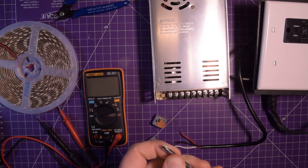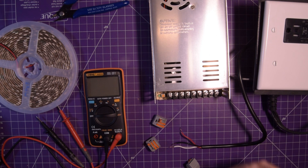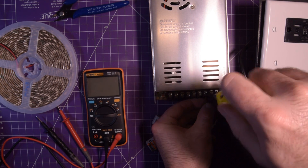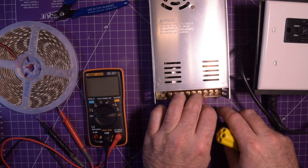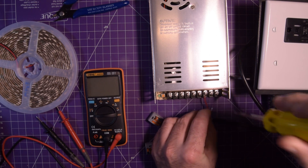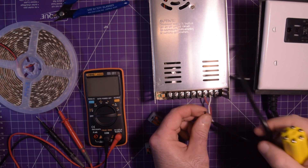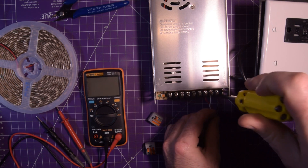I'm perfectly fine when things are unplugged. I'm also perfectly fine when I don't have to touch the device to turn it on or off in case of anything going wrong. That's why I built that little test unit. It's not a fancy commercial unit because I didn't have a hundred dollars US to throw at one, but it does work. I think compared to just shoving wires into an outlet, I have several orders of safety magnitude more than that. And this cable is actually running through the GFCI as well, so I think I'm pretty good.